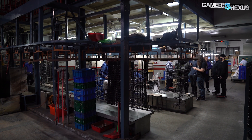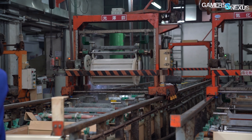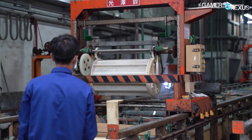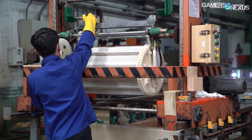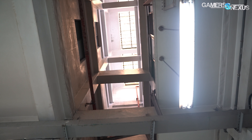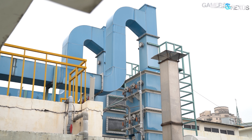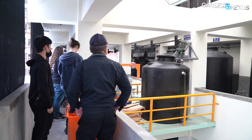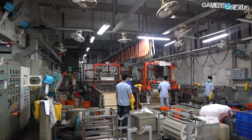The more unique of the two processes used at this factory is barrel plating. Small parts are placed in a non-conductive plastic barrel full of tiny holes, looking somewhat like a lottery drum, and spun in the same sort of cleaning and electrolyte baths as the racks. Cleaning is done on the shorter of the two lines, under a structure that resembles a greenhouse, which acts as a fume hood to capture and remove harmful vapor, piping it up to a network of blue ducts on the roof that scrub toxins from the air. The rooftop cleaning solution is extensive and spans multiple stories of the building, including a complex network of tanks, tubs, ducts, and filters.